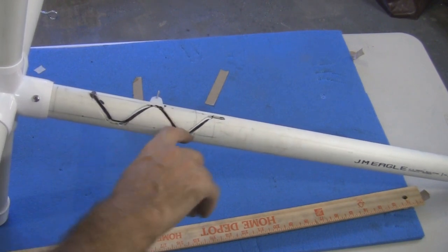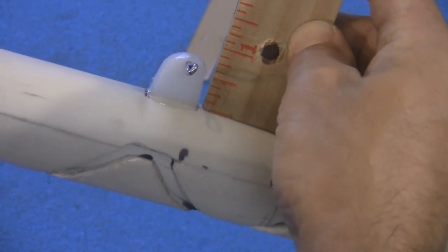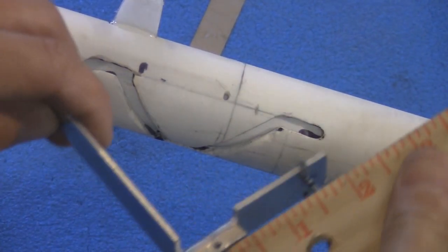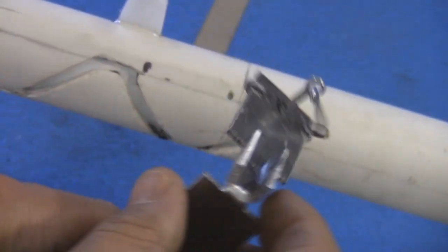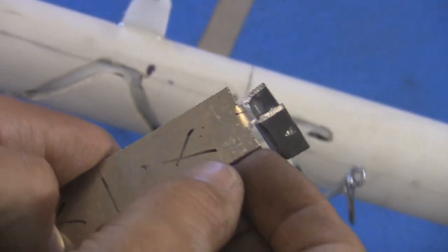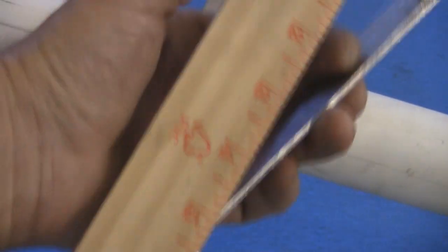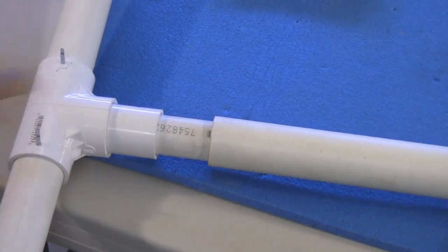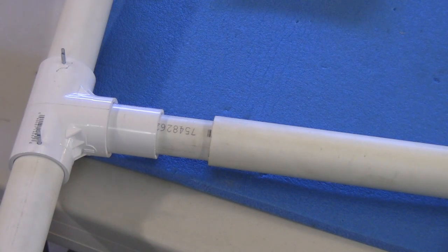This small piece of plastic is about three quarters of an inch high and three quarters of an inch wide. The aluminum arm part is about two and a half inches this way with the hole drilled at about two inches, curled up around a screwdriver handle and knocked in with a little hole drilled in it. This end here is about six inches. You can also drill a hole in the coupler part and put a pin in there if you felt the need - I have not found the need to do that. Now you have no excuse for not having your own drop turner target.